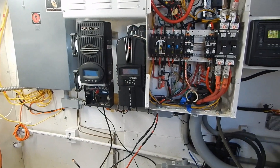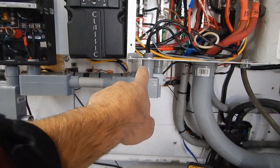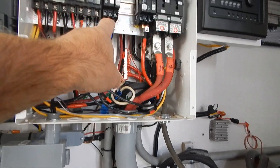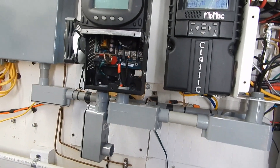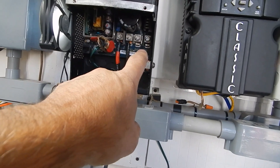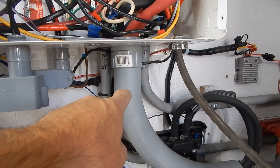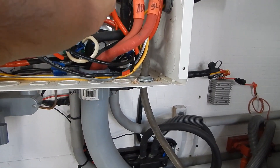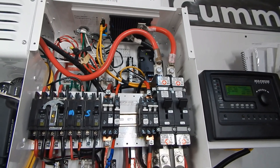About 70 minutes later: I've got the conduit in. I've got the number six wire coming in from the solar PV input, going up to the 63 amp breaker, out and around, back down through these boxes and up to the positive and negative. This is what the battery cables are going to look like from the charge controller — number four gauge cable going from the battery positive and negative, through here, down through here, across here, and into this hole, straight up to the breaker negative, up to the negative bus bar up there.